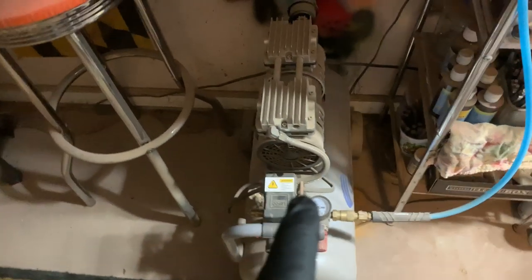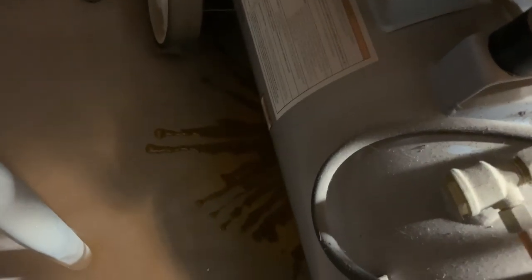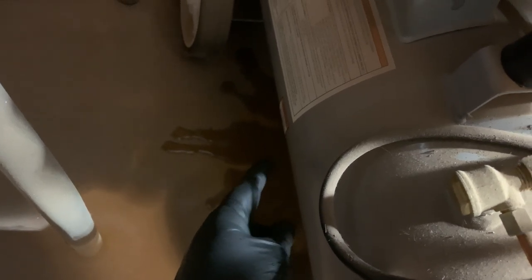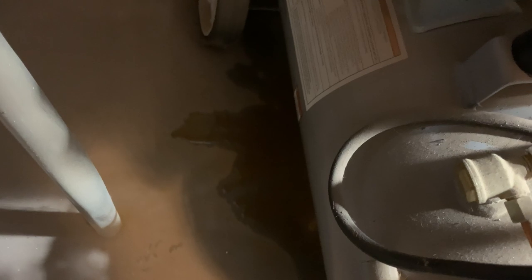The other thing that you want to do — if you have an air compressor that's got a tank — make sure you remember to drain it. It's going to be really loud, but you guys should be cleaning this and draining it every couple of days. Because if you don't, your tank is going to rust, and you don't want a rusty tank. You want to extend the life of this air compressor as long as you possibly can. Just simple maintenance tricks like giving this a bleed every couple of days. The nozzle's on the bottom, and I'm going to leave this open so that it can continue to drain and dry out while I'm gone. There's no sense in keeping it closed — I'm not going to be using it, I don't need any pressure in it. I'm going to let that bleed. It's just a concrete floor so I don't care if I get water on the floor, but if you want to put a drain pan or drip pan over that, go ahead.